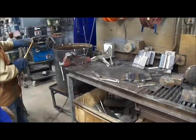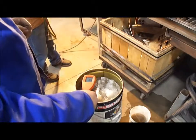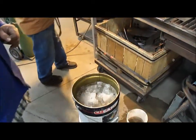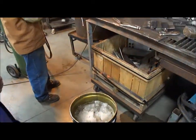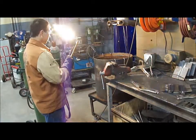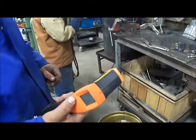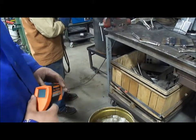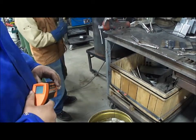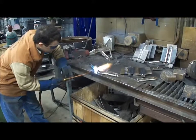As you can see, we've got 32 and a half degree water — it's a slurry snow mix. We're heating with a rosebud on an oxygen-acetylene torch. The temperature sensor only goes to 1,000 degrees, so we know when we'll hit over 1,000, but beyond that we're going to have to go off color.